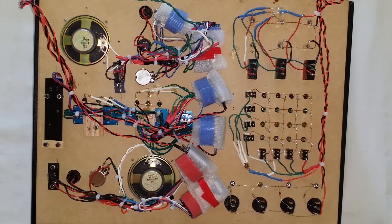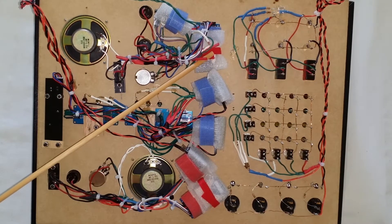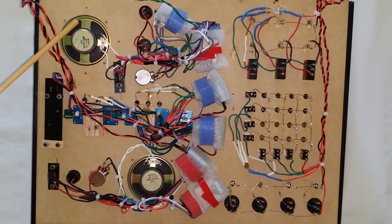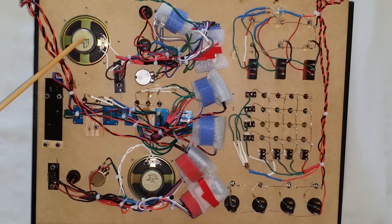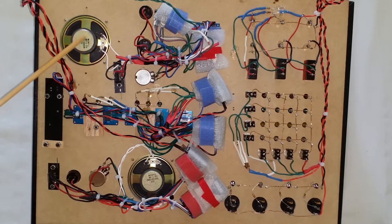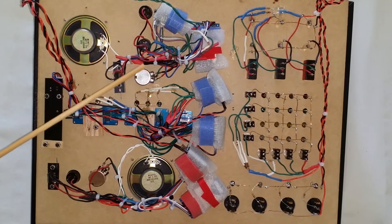So these are the working components of the Apollo Command Center. It's basically driven off of four Arduino Pro Minis. This one drives the mission control section — it's attached to an SD card reader which I recorded a bunch of WAV voice commands and mission information on. These are 8-ohm 0.3-watt speakers. Getting adequate amplification with Arduino is a bit of a trick; I ended up using an NPN transistor, a 2N4401, with a resistor, and that was the simplest approach and worked as well as any others.